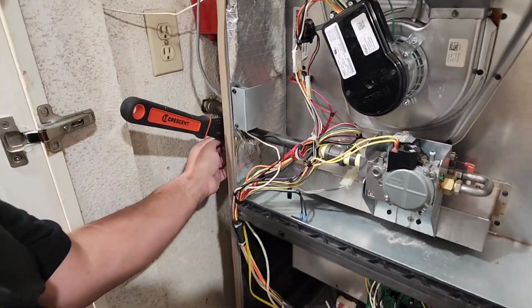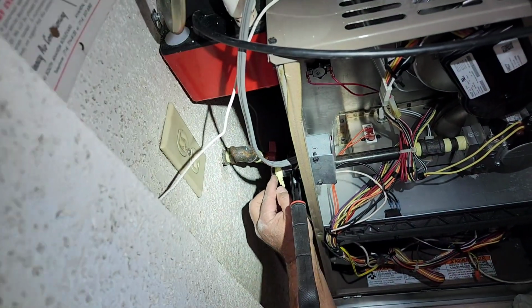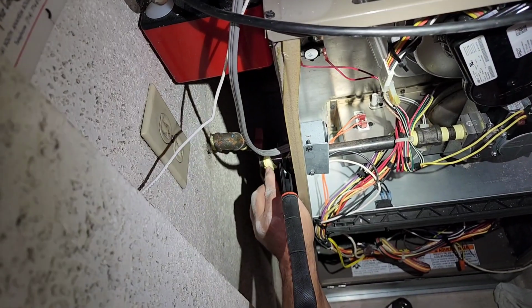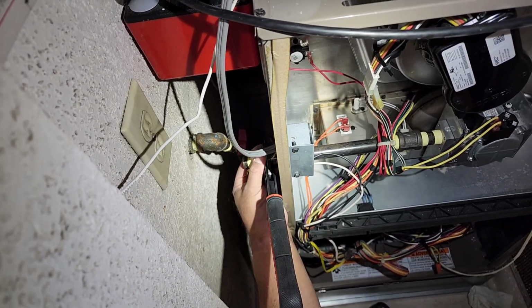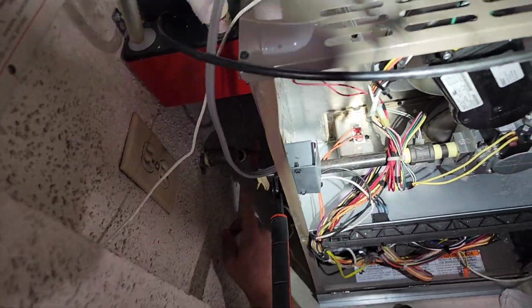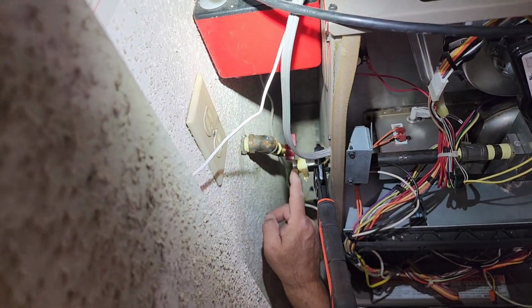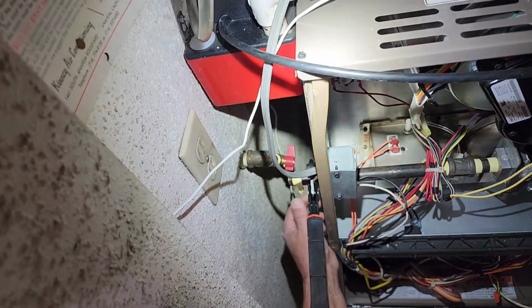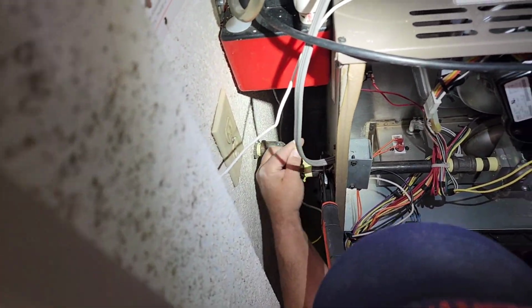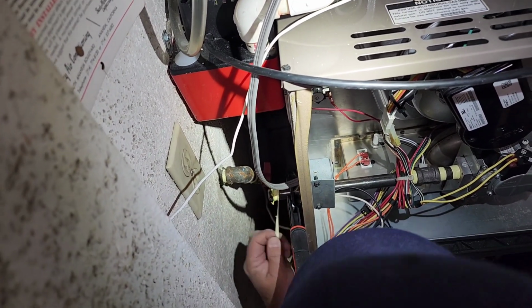Oh. Look, guys, this is what I was talking about. You see how that fitting, all that thick yellow tape, instead of staying on the threads and having a nice yellow film in the threads, it's all pushed up and you get a rope. You got this thick rope. All that stuff does is get pushed up in there. Usually with the Blue Monster, if you unthread it where I put it, you would see Blue Monster in the whole, each one of those threads would be laminated with Blue Monster. None of this. This is just a big old thick rope right there. It's this yellow stuff that's so heavy, I hate it. I mean, the proof is in the pudding. You can just see it with your own eyes. But anyway,